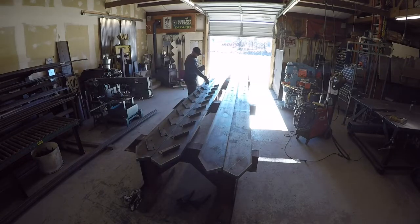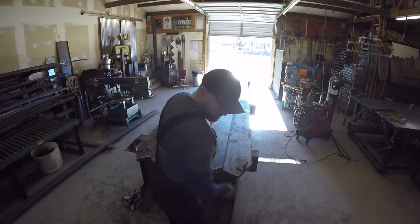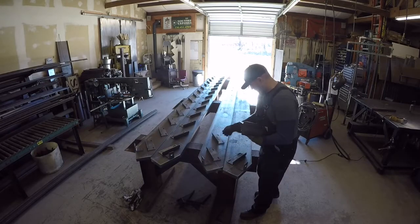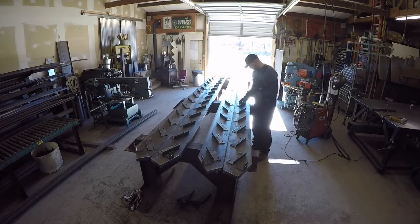I've sped this up just a little bit for time's sake since it's kind of monotonous to watch. I'm just laying these out on my lines — I've got nice easy-to-see chalk lines. I'm laying out these clips for both sets. You also have a mounting bracket — some type of angle. In this case we've got three by three angle on the bottom clip and three by five angle on the top mounting bracket. The bottom one uses an anchor that goes into concrete, and on the top you use lag bolts that go into the platform or landing where your stringer is attached.